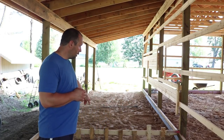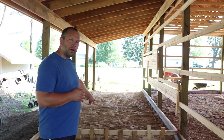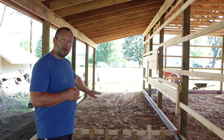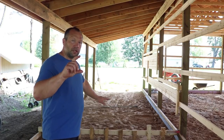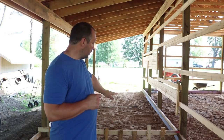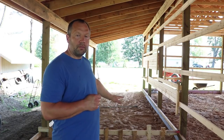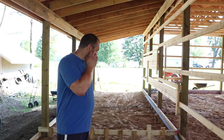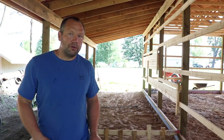I made this rake from 2x4 scraps and set it at 4 inches deep. Those teeth on the rake give me my depth — that's where the sand needs to be to achieve the right concrete thickness. Let me show you a few other details.